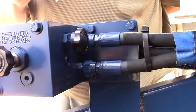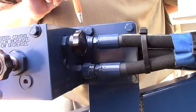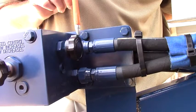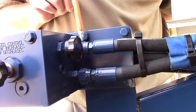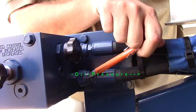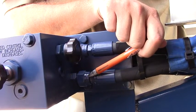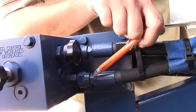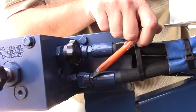When plumbing the spreader hydraulically using the four-line manifold valve, on the back side here, this is the motor return. This is the motor pressure. So if you ever perform maintenance on this, or for any reason, you need to be careful because it is inversed on the front.